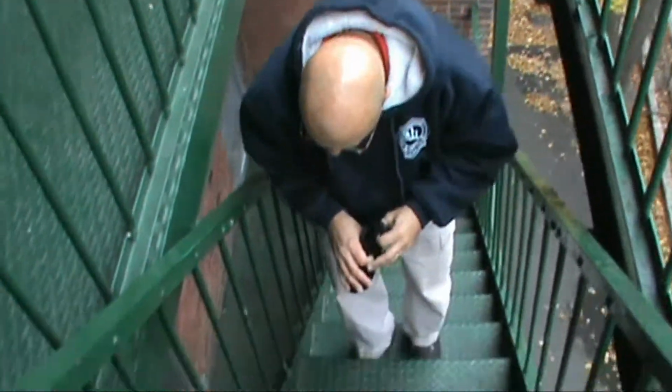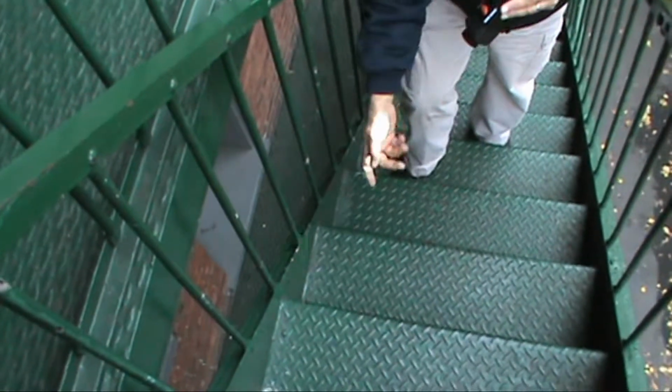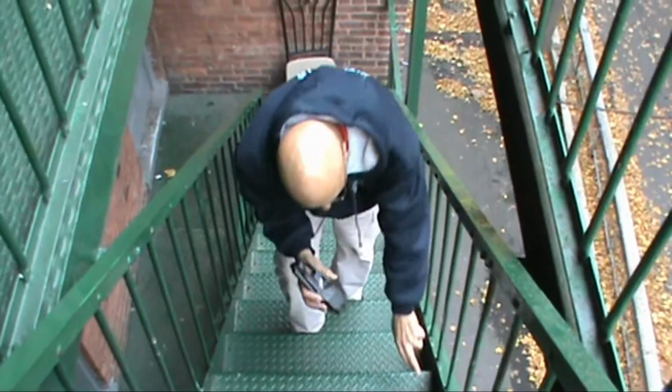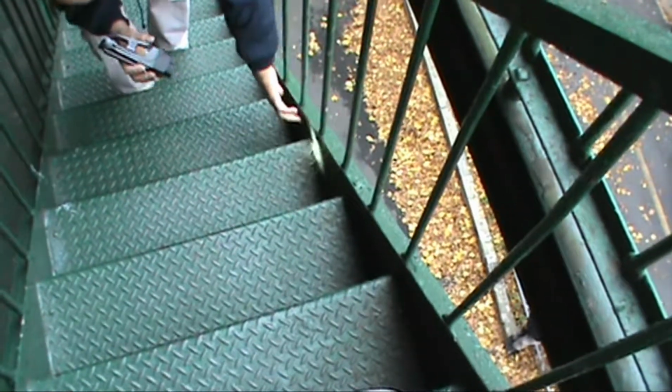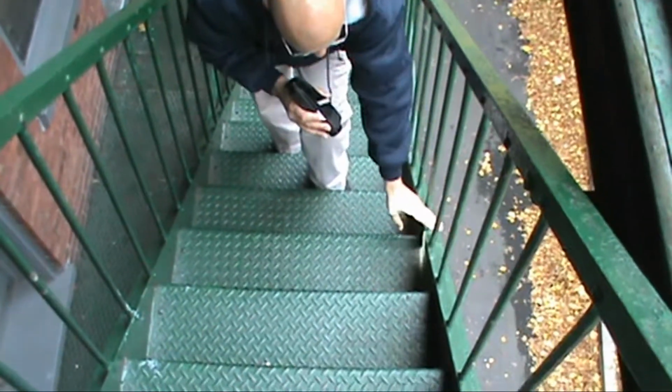But in the meantime, I want all these sealed with silicone after, because this is where you throw the salt, and it's getting in there and eating up all these welds. Okay, going down, rails on these sides. These rails are notorious for capturing water and dirt, so get these all sealed up. Once you clean these out, just seal them up so that the water and the rust doesn't get in there and eat the seat channel and the rail.